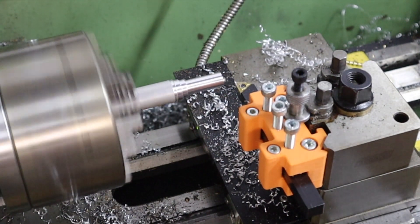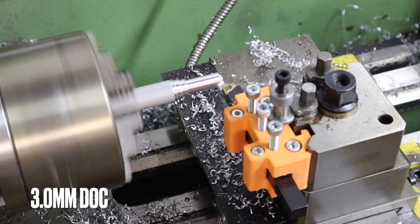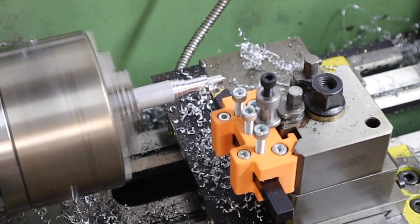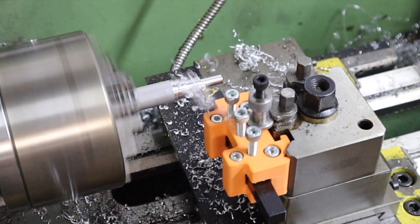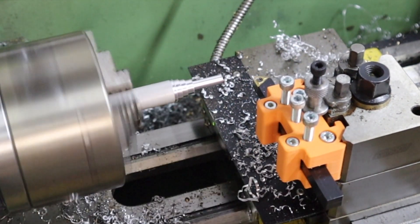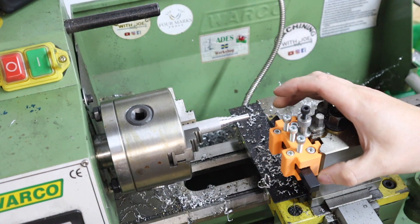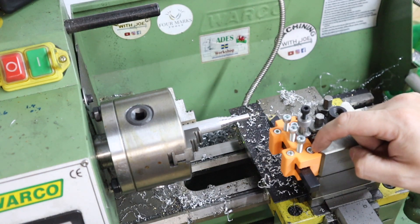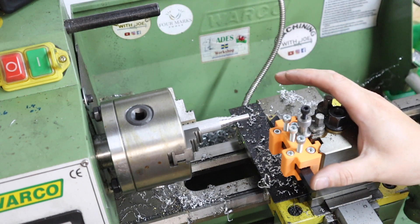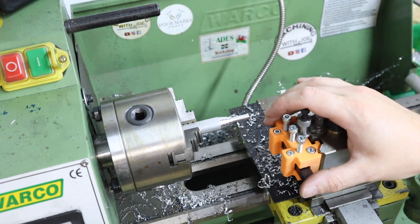It's pretty good. We're running out of material here, so I'm going to bump this up to 3mm depth of cut. That is insane. That last cut was a 3mm depth of cut and the tool holder didn't seem fazed by that at all. I was thinking PLA was going to give out first, and looking at the results, it hasn't. I think for the next two tests I'm going to need some bigger stock, and start at a larger depth of cut to see what these things are really made of.